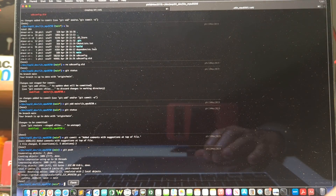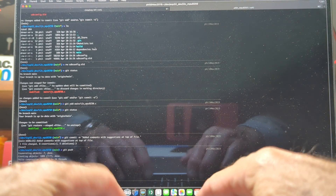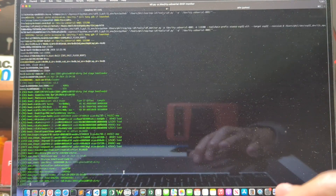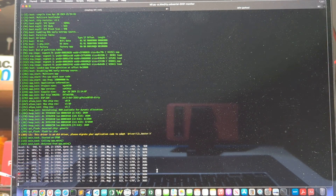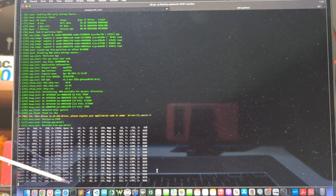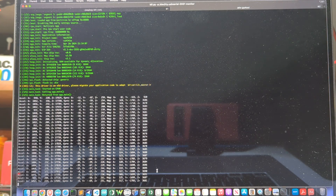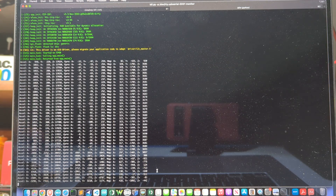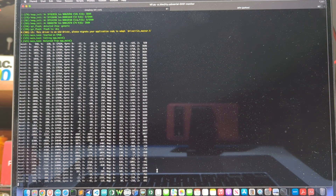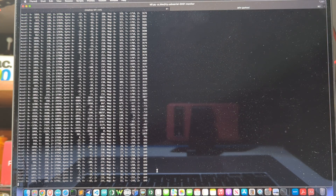I'll go to the console and run this. It's actually running so I can just monitor it, and there we'll see the data start spitting out. It's got the accelerometer first — X, Y, and Z — then the gyro X, Y, and Z, and then the magnetometer X, Y, and Z. I'll move this thing around so you can see the values changing. That's the extent of it — I wanted to play with I2C and a real-world sensor. The code is working and I'll check it into my GitHub and provide the link below.